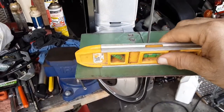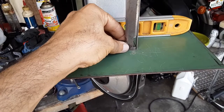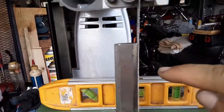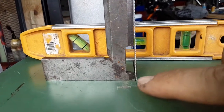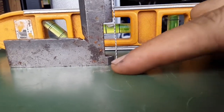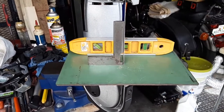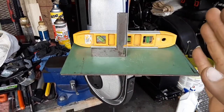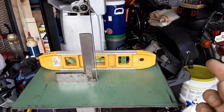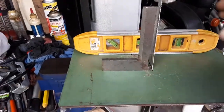If I grab my little square and put it right there, as close to the edge as I can — look at the difference. It's pretty much lined up with the blade. And at the bottom there's about a sixteenth of an inch gap. So by using this extended table it actually made it a much closer fit. It brought it in a little bit more. I believe if I lifted this side more — hence why I put that washer under here — to lift this table more square with the blade. A sixteenth of an inch cut on small material is not going to make too much of a difference.